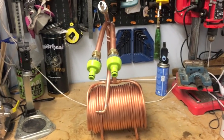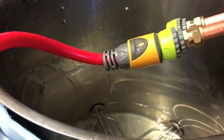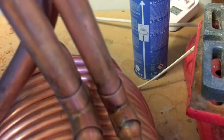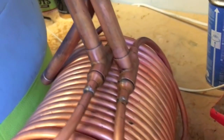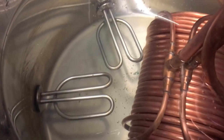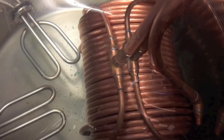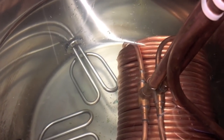So let's do a few quick tests on it and then we'll hopefully get some footage of it in action. So a quick leak test first of all, just collecting some water in the kettle to test out the whirlpool afterwards as well. Everything is looking nice and watertight. So we've got some water in there - this is about the depth I would have for a typical 21 or 23 litre batch. As you can see it's all fully submerged, which is one of the advantages of having the horizontal coils rather than the vertical ones.